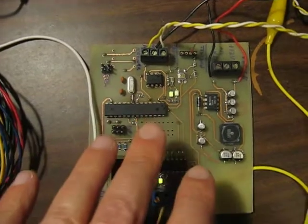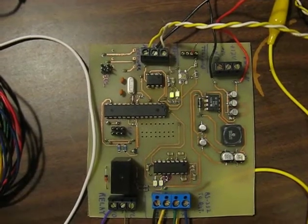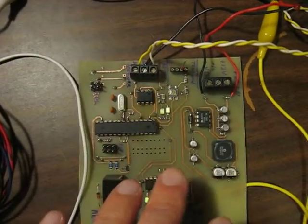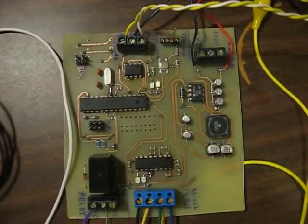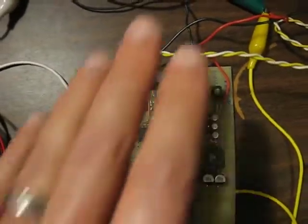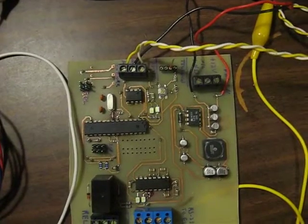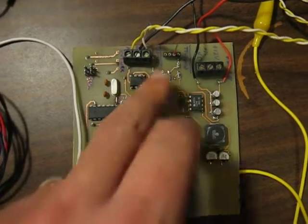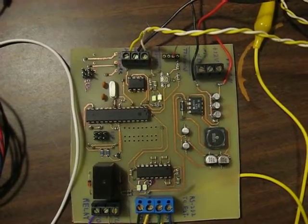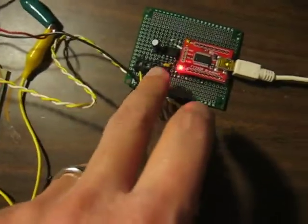RS-485, particularly when it's in a multi-drop configuration, is typically half duplex, so that means only one side or the other can talk. The advantage, though, is that there can be more than two transceivers on the bus. You can have up to about 30, in fact, or in this particular case, this chip advertises that it's a 1/8 load, and you can go up to 256. The trick is that since only one person can talk at a time, you need a protocol implemented on your bus that ensures that only one chip actually speaks. So all of the chips on the bus have to follow a set of rules that make sure only one guy talks. Anyway, what we have for the moment is this RS-485 just leading up to one other node